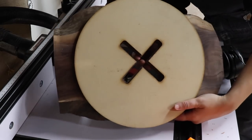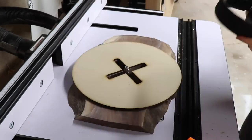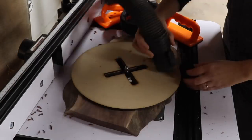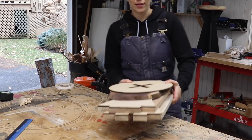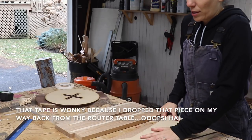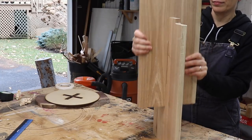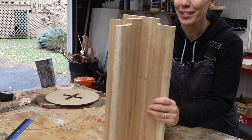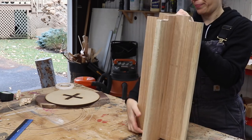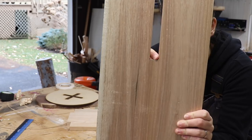Same with the top — I have to be very aware of the direction I'm moving the piece. If using a handheld router, you go the opposite direction from the router table. Now let's take off the templates and see how it fits fresh off the router — save these, so be careful taking them off. The pieces click into place. It's super satisfying that it fits, but if you look closely up top there, you'll see it's not flush, and that is because of the round router bit. There are just these tiny little corners that need to be cleaned up.